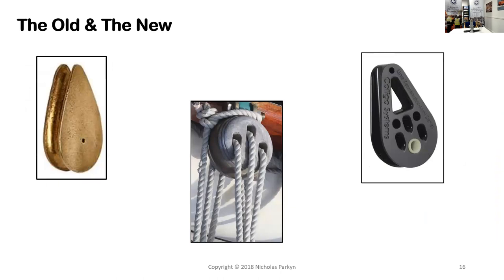Looking at old and new: the new type of termination fitting used on rope rigging incorporates an aspect of the solid thimble and can be used either with a pin or with a lashing. The fitting itself is hard anodized aluminum. Where the pin goes through the fitting there is a layer to insulate the fitting from the pin on the rigging screw — obviously for purposes of preventing electrolysis.